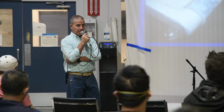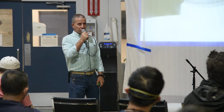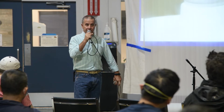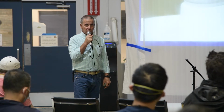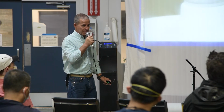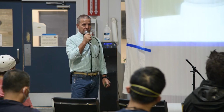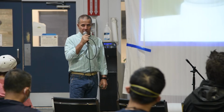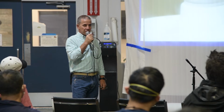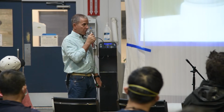Where there's a fast pin that's being inserted into a hole that's painted aluminum, again, it's hard to avoid having chafe there and having failure in the paint. You know, there isn't always an answer to every one of these questions, unfortunately, but there is to most of them. And again, that hole drilled in an aluminum structure that's painted, which then has a metallic pin put into it, is probably the most challenging scenario because there isn't a good way to isolate those two. But for a pivoting surface, you can use a bushing that will create isolation.